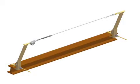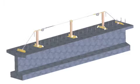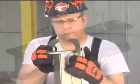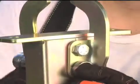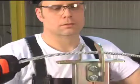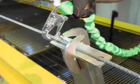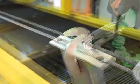Single-span systems are available in 30-foot and 60-foot lengths and accommodate up to two workers. Standard multi-span systems are available in lengths up to 300 feet and accommodate two workers per span. Multi-span systems provide a continuous pass-through design which allows for 100% connection to the system. A single-leg lanyard or self-retracting lifeline can easily pass through the heads of intermediate system stanchions.